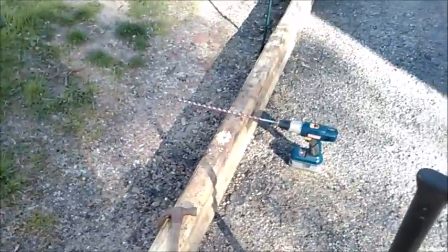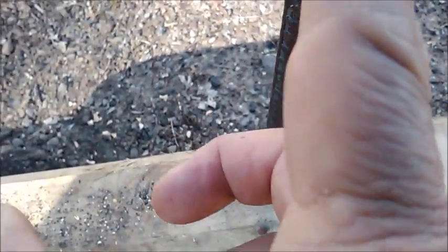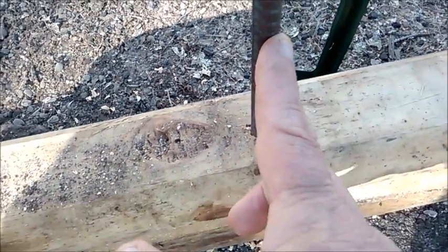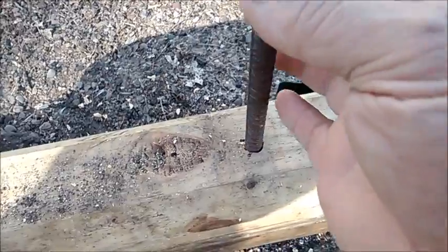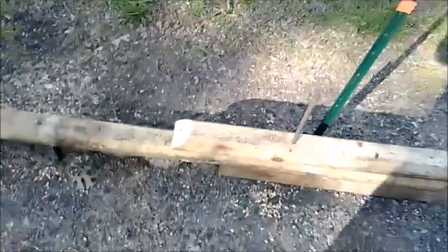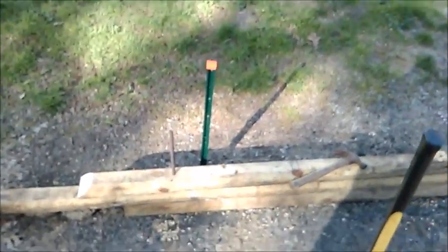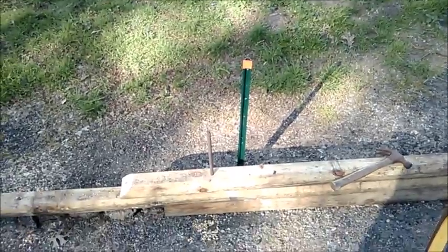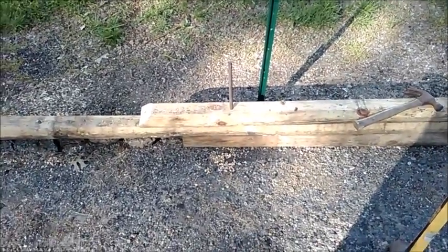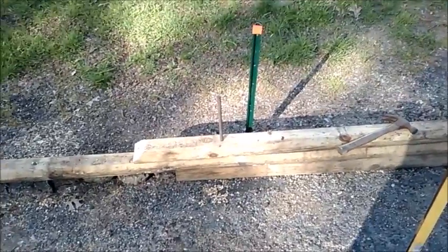The thing about this is that's a half-inch bit, and this rebar is half-inch rebar. Because of the nature of the wood, I force this down in there and then the wood will actually swell up around these pieces and grip on the ridges — kind of the same way that when concrete hardens around it, the concrete uses all those little ridges to hold it together. I've got 13 pieces of rebar.